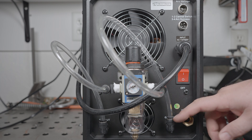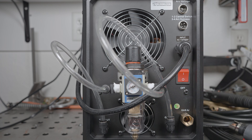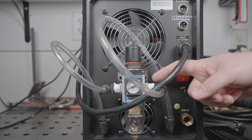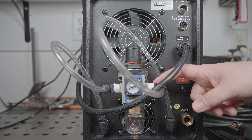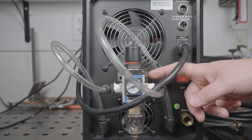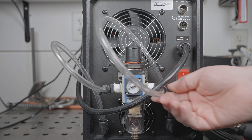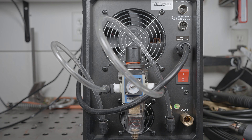They include fittings that are very easy to quickly connect and disconnect with the included semi-rigid hose, but the included regulator does not have tapered threads even though the threads on the included fittings are tapered. So I had to use about 10 wraps of Teflon tape to get the fittings to seal in the regulator, and they're still not super tight — basically hand tight by the time they bottom out. They seem to seal and I think they'll work, but I don't know why they wouldn't just use the right threads in the regulator.